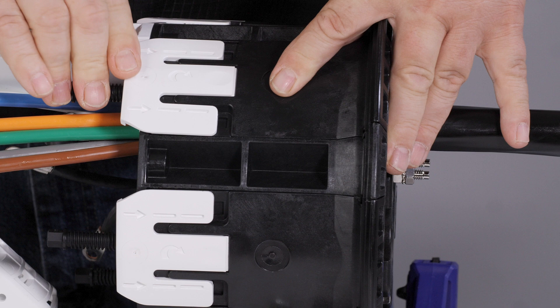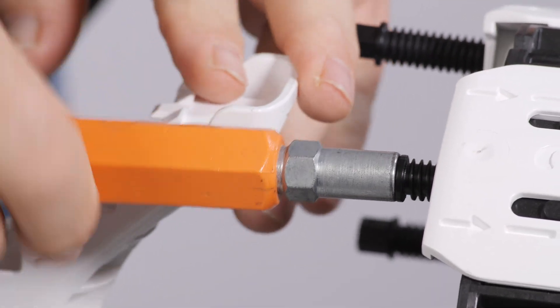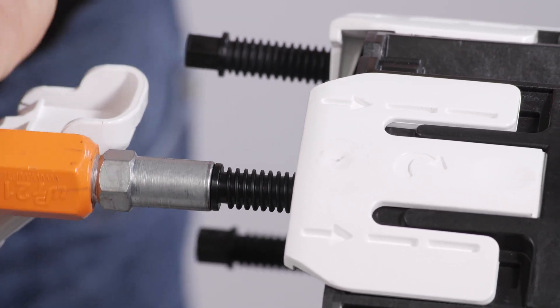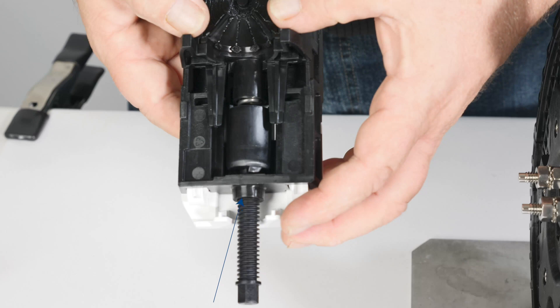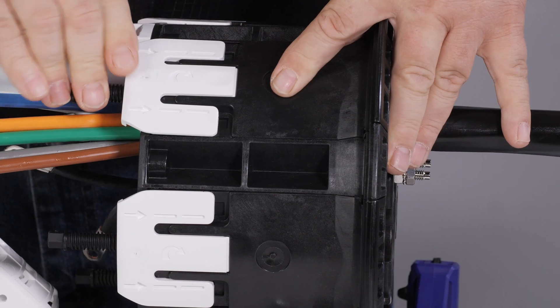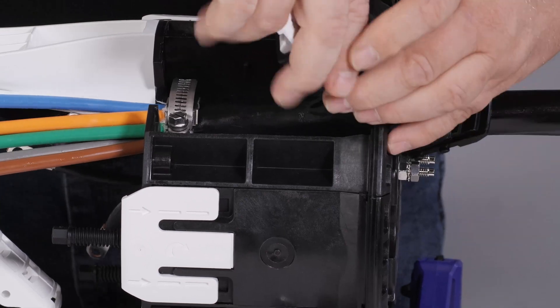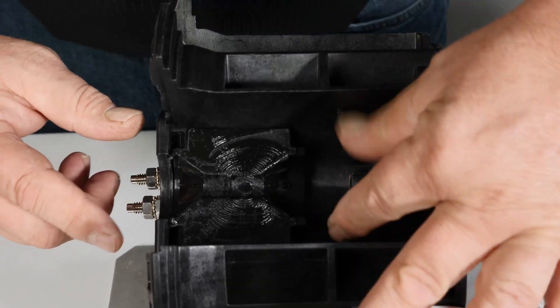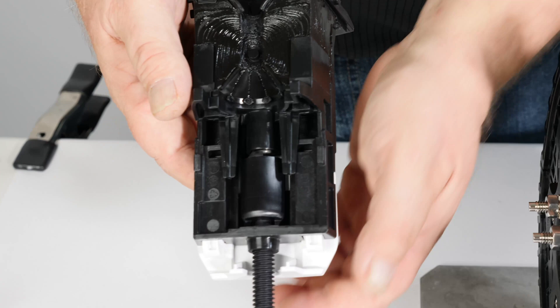If a sealing wedge needs to be removed to allow access to the cable and cable attachment unit, completely loosen the gel compression screw. The sealing wedge will stop the gel compression screw once it reaches its full relaxed position. If the gel compression screw unthreads from the sealing wedge, simply reinsert the screw and thread it back in place prior to unlatching the sealing wedge. Depress the locking tab and slide the sealing wedge down toward the bottom of the base to release the latch. Slowly rotate the top of the sealing wedge from the base to expose the cable with cable attachment unit retention. Depress the base gel and elongate the sealing gel as shown each time a sealing wedge is removed. Set aside the sealing wedge in a clean location.